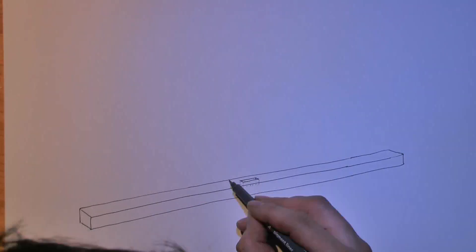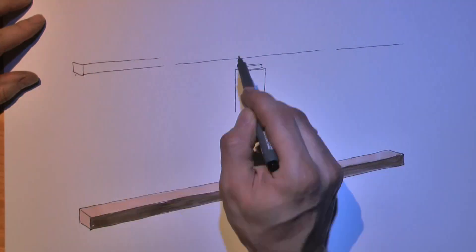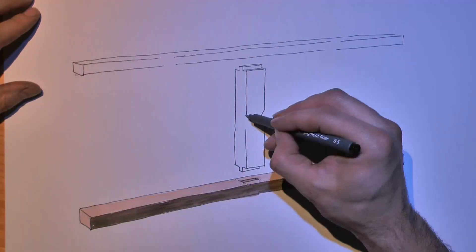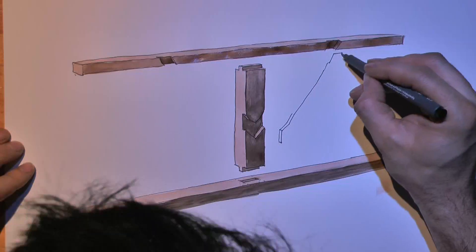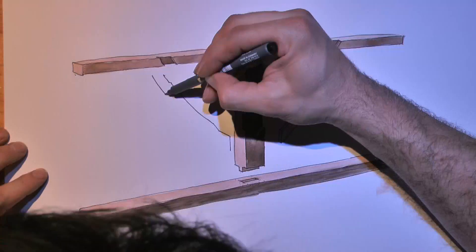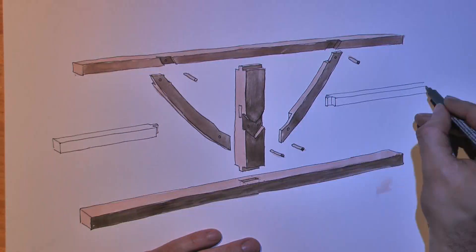The typical elements of this timber frame structure are the horizontal sole plate, the vertical post or stender, and above it the top plate or ram. Then the braces with their lap joints, held in place by wooden pegs.